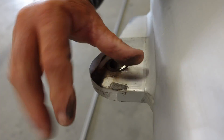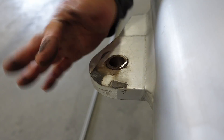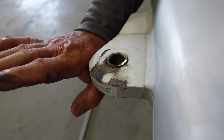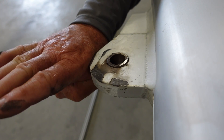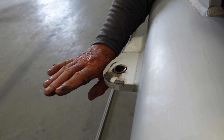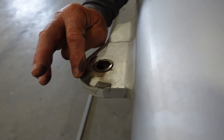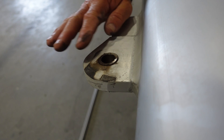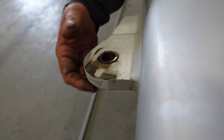You can see this wear area here — when you tack or go downwind, the headstay is moving like this. You don't know it, but it's minor up here. This is the wear that happens from the toggle. You can feel there's a ridge there, and there's a ridge there. Hopefully we can fix it by making the toggle able to move freely.